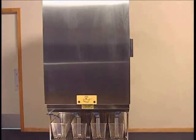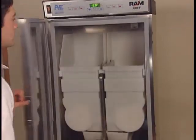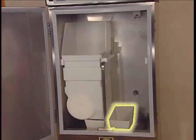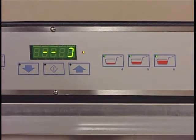Calibrating the scales is another key to the dispenser operating properly. Before you begin the calibration procedure, you'll need two 1-pound or 450-gram reference weights. If reference weights are not available, four frozen quarter-pound patties or a 1-pound block of butter will work fine for each reference weight. Begin by removing the hopper from the dispenser for the side to be calibrated. The accumulator housing on the side being calibrated must remain in place on the accumulator doors. Go to the operator panel and press the up arrow until the display reads U2, then press Enter. The display will change to 'Cal' with flashing brackets alternating from left to right. Select the side to be calibrated by pressing a basket size button on the right or left side.